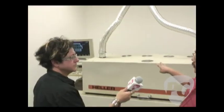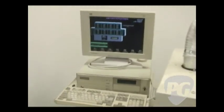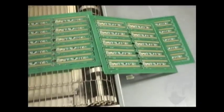The next board will automatically feed in so it'll keep running. These boys will inspect it, make sure no parts are tombstoned — meaning standing up on their side — or off center. They're supposed to be laying flat in the right positions. Then they run it through this reflow chamber. This has four zones, one zone on top and one zone on bottom, so there are eight heaters in here. It gets heated up until all the solder reflows, and little fans cool it off as it comes out the back.